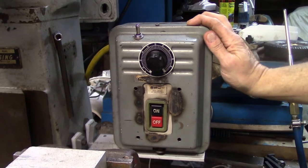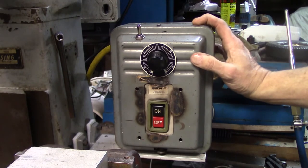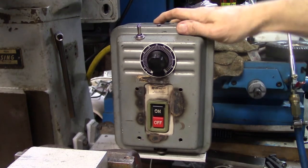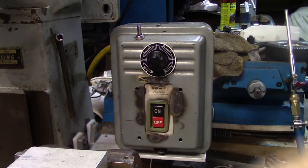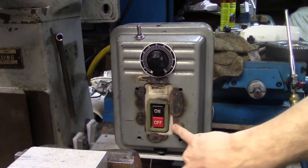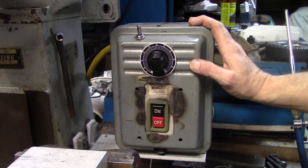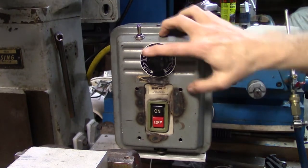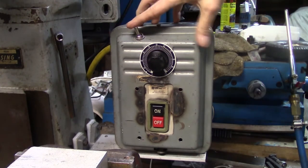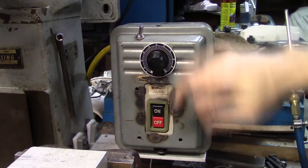The speed control is a Baldor DC motor controller I picked up off eBay, rated for up to one and a half horsepower. There's a little resistor you put in to match the motor speed. I had a nice heavy-duty electrical box on hand, drilled out the original plate, and welded on a momentary push button on/off switch. It needs to be cleaned and painted but it does the job. There's a potentiometer here, and I've got forward and reverse via a double-pole double-throw switch that reverses polarity on those wires.